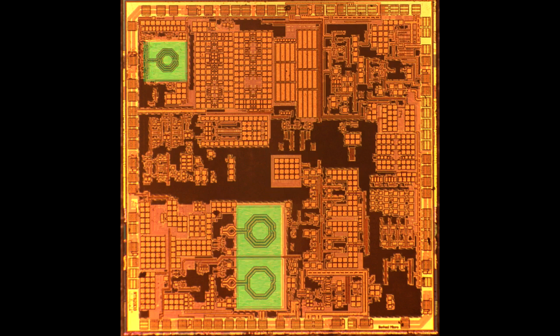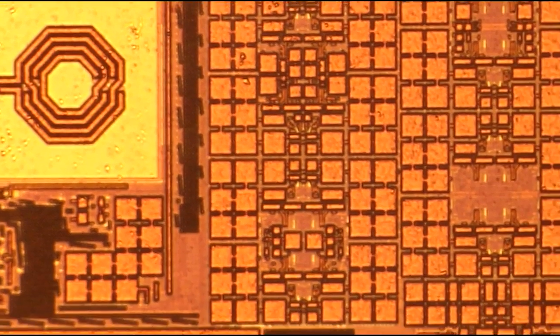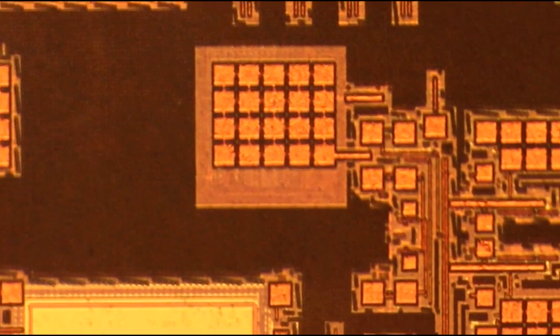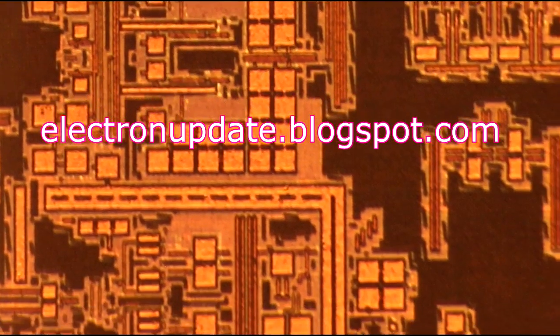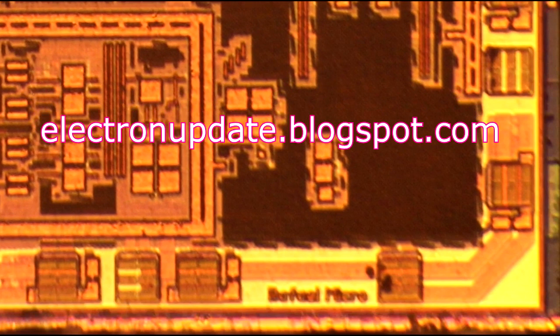The most obvious structures — those three there — are inductors, which gives you a quick hint you're almost certainly looking at an RF type function. You don't get a lot of inductance there but more than enough for what's going on here. There's going to be a VCO of some sort and then a bunch of mixers, and they're going to push out IF onto it. As always, I'll throw this picture up on my blog if you want to take a look at the actual die and sort it down further. But it looks like a typical RF construction.